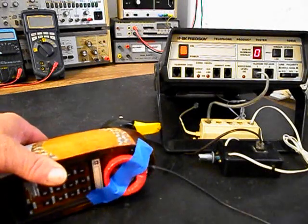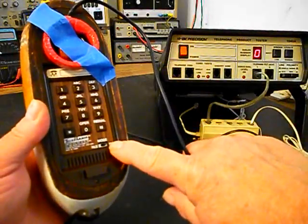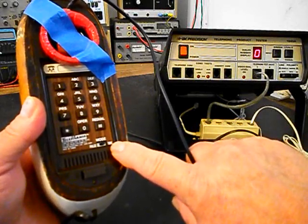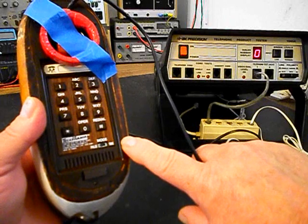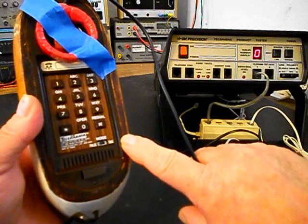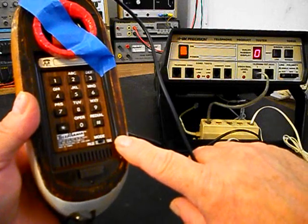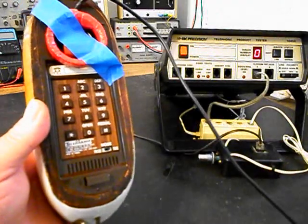We also want to mention that we installed another piezo buzzer, and there's a switch that was used originally for the pulse and tone mode of a telephone, and we have the switch to the right position, which turns off the piezo buzzer. And then if you hit the switch to the left, the piezo buzzer will come on. So we turned the button for pulse and tone into an off and on switch for the piezo buzzer, which we're not going to use because we want to hear the quacking sound that we installed into this duck telephone. So that was another situation that we wanted to go over.